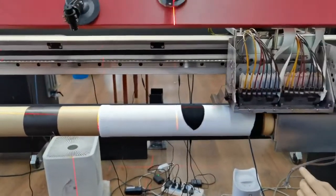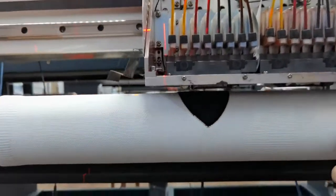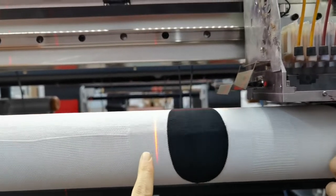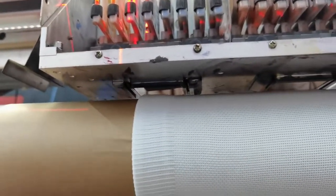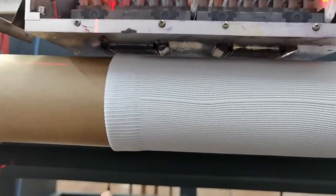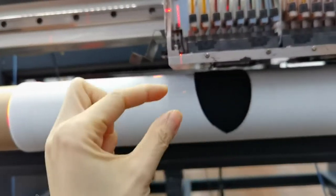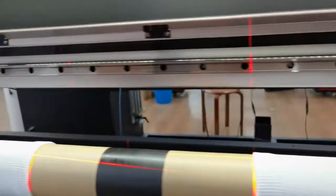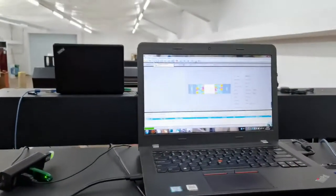We test the height — about two to three millimeters. The heel part is normally higher than the other parts of the sock. We check whether it will scratch the nozzle surface, because if it scratches the nozzle surface it may cause the print head to clog. It's better to check especially the cuff side and the heel side to make sure those two higher positions don't scratch the nozzle surface. This is a two-head machine — we do the same check on both heads. Then we click print.